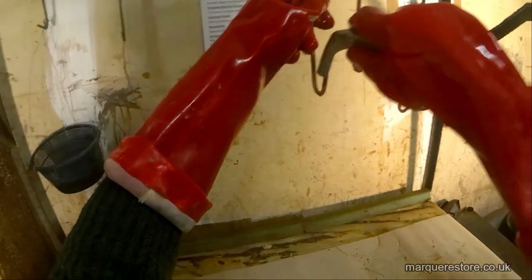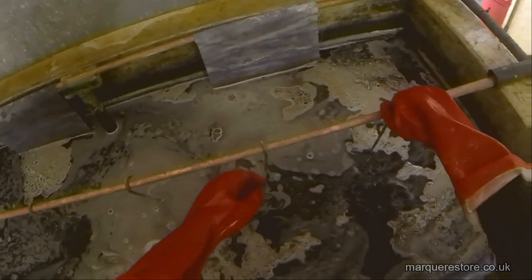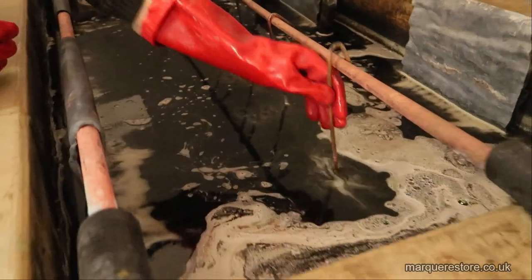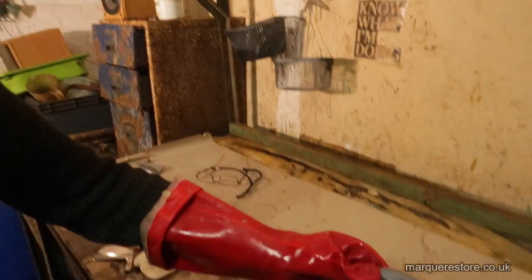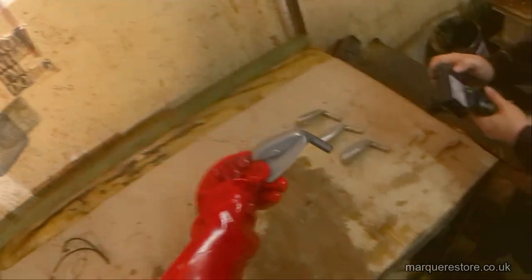Here the clubs are being fitted onto copper hooks so they can be put in the stripper. This is mainly sulfuric acid and we're going to reverse the process — the workpiece is the anode instead of the cathode, so it actually takes the plating off back to bare metal. Then they're rinsed off in water and they're ready to go into the polishing shop.